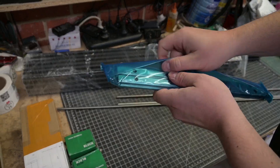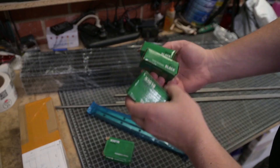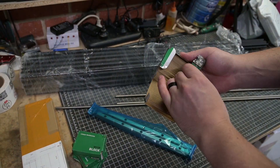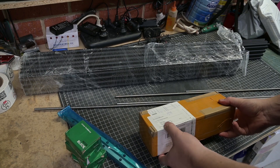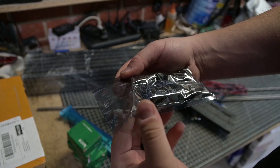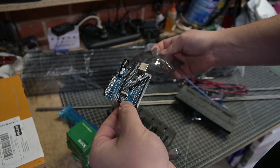It's a design that uses V-slot aluminium extrusion on which rollers run, mounted to 3D printed carriages. I don't have high hopes for the longevity of this roller system, so the Z-axis design does deviate to save future rework effort — using 20mm rails and wide carriage blocks. To drive this whole system, I'll be using an Arduino Uno paired with a CNC shield and NEMA 17 steppers.